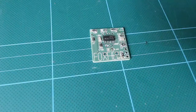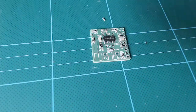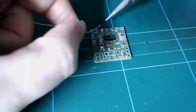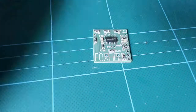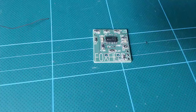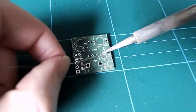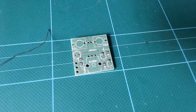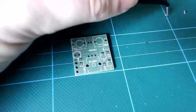The capacitors aren't marked, so be sure to read the build guide for which is in which bag and which goes where. And there we are, all done. Now we'll flip the board and prep it like before, one blob on each of the sides of the component pairs. Let's start with the front passives. So first the fuses. These are just like the resistors, they can go any way around, they're quite straightforward.